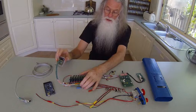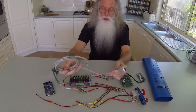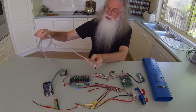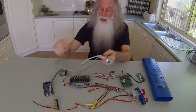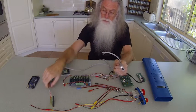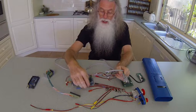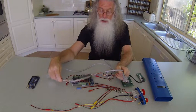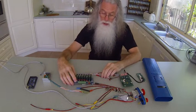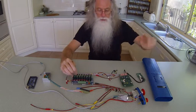That then goes through the tube of the table, and then you just get a cable that's an old modem cable, that type of thing, and that will then just screw in, run to the control box, and then these wires will fit in the necessary connectors, and I will make up another type of plug like that with the screw type terminals. If you have wires, they can tend to break off, so this type is quite robust, so I'll show that in another video. So that then just runs in there. So that will be the complete CNC4A SX3 CNC ATC mill.